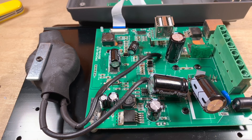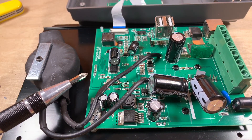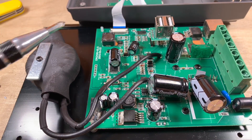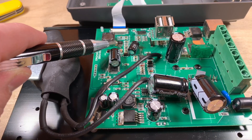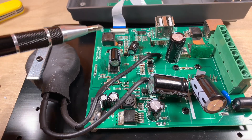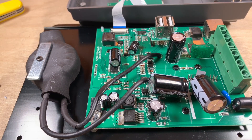Looking from a slightly different angle, there are a couple of things I'd like to point out. The main microcontroller seems to be under this electrolytic capacitor, marked UE32120B1 — that could be a custom module. There's also an inductor and a little 8-pin chip which I suspect is the 5-volt regulator needed for the microcontroller, and probably providing 5 volts to the USB ports as well. One interesting thing on the silkscreen: there's a diode symbol marked D7, but they've actually just tacked a piece of wire across it. Clearly they thought either they don't need a diode there, or they just ran out. We'll see when we turn this on.